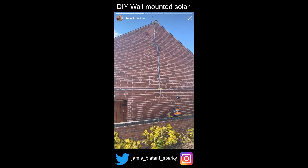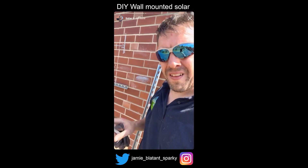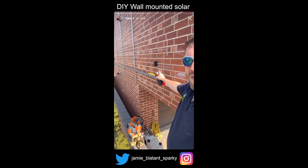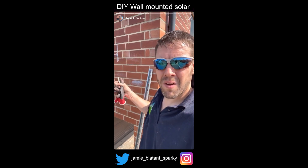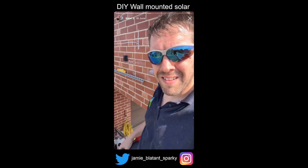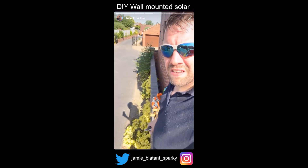I expect to not finish, probably. Thinking about what access equipment I'm using - am I being safe? The answer is no, I'm using this wall. My plan is to use some steps to get on the wall - I'm not just climbing up. This rail here is going onto these upright rails and I'm going to bolt it up, and this is what I'm going to tether my ladders to so they don't slip off. Also I've checked no one's working below me, because that'd be a moronic thing to do.